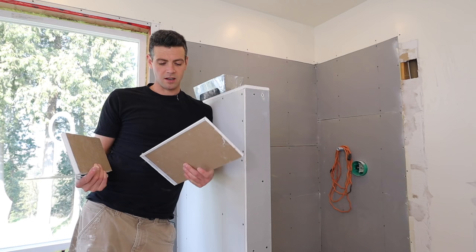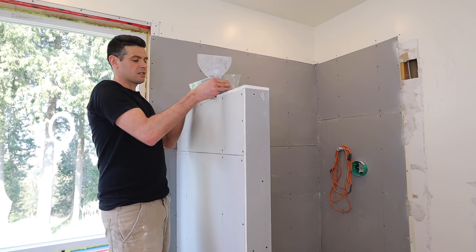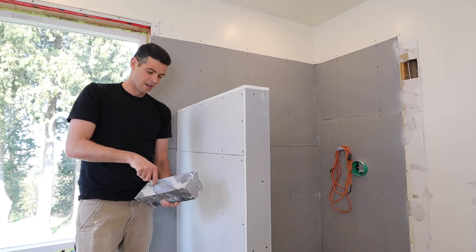There is actually such a simple and easy solution that you're going to be disappointed you even clicked on the video to watch it, but if you don't know — the reason this is a problem is because normally you have a recessed joint that fills in with tape and mud really nice and easily. But as soon as you have a tapered joint meeting up to a factory joint, you've got this lip here that you can clearly see the daylight through.